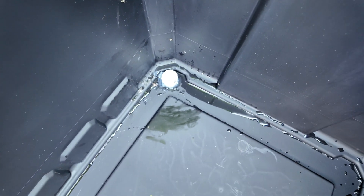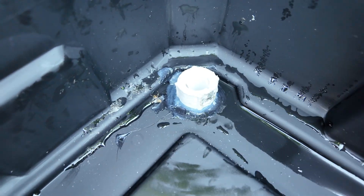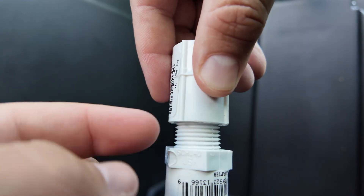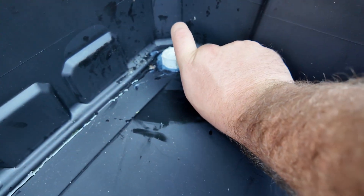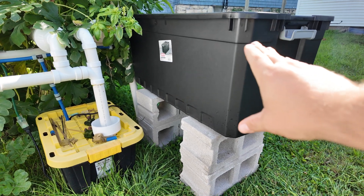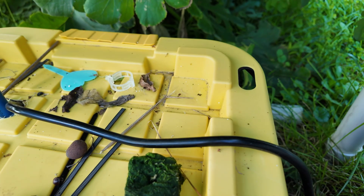I must admit I already set up my pass-through. There's silicone around here — I cut it with a handsaw. It's just a half-inch coupling that's threaded and a male adapter screwed together, with silicone and pipe dope in between. I cut along the line with a handsaw so that when water sits in here we end up with just a half-inch of water that doesn't get drained. This reservoir has to be elevated so we can come down 90 degrees, across, and straight down into our current reservoir — everything needs head pressure pushing it down, just like a water tower.